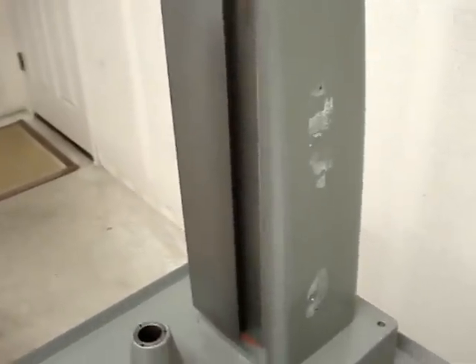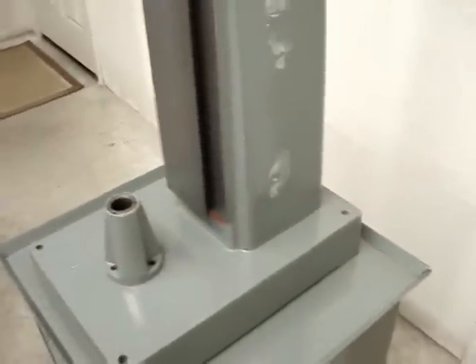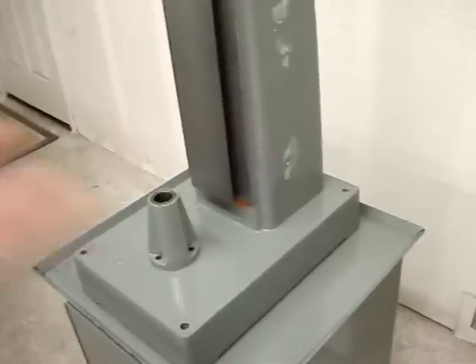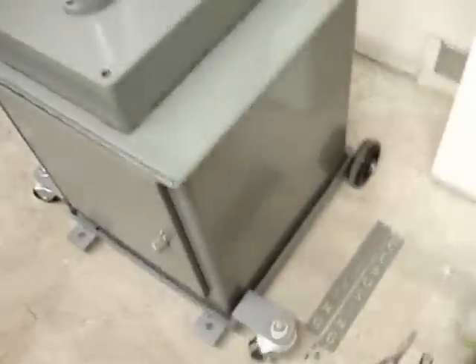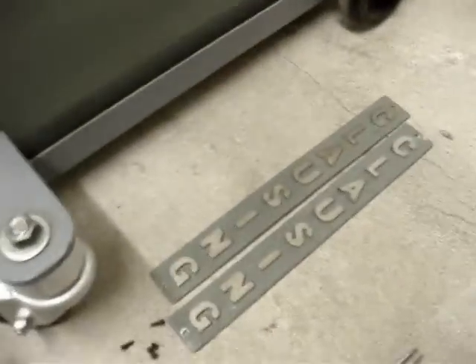As you can see, when you get into restoring one of these there's a lot going on. My plan, as I may have mentioned in previous videos, is to just clean the mill up at this point and not do a full restoration stripping it with paint remover. Ultimately I think I will do that, but for now the plan is to take everything apart, clean the bare metal surfaces, address the really heavily rusted areas, and get the mill functioning. Then after it's fully operational, I'll consider stripping it down and repainting with a heavy-duty paint in a slightly different color.